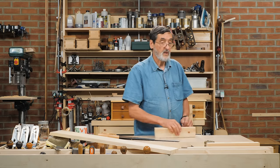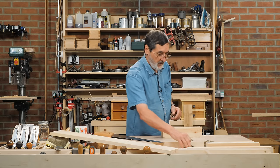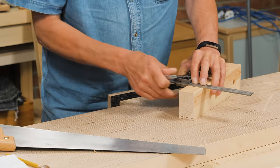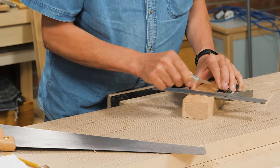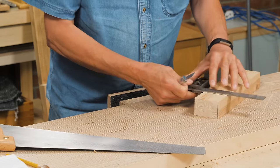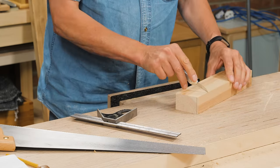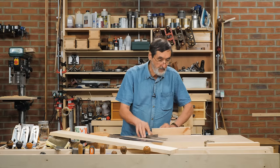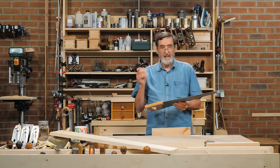So what do we do when we want something a little bit more refined? If I've got a piece of wood like this that I want to cross cut — take this waste wood off here — I use a knife wall and I go all the way around my piece of wood like this. That knife wall should come out right on that corner. Now instead of using a pencil line, which isn't as definitive, the knife wall gives me the definition and the exactness that I want.